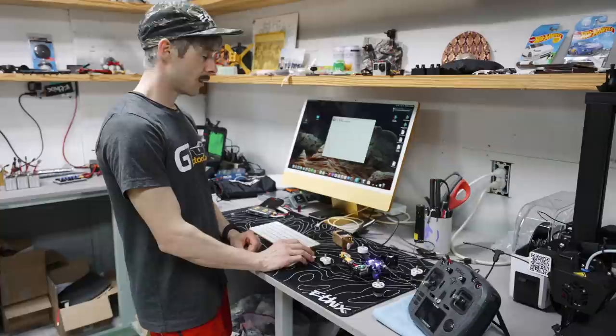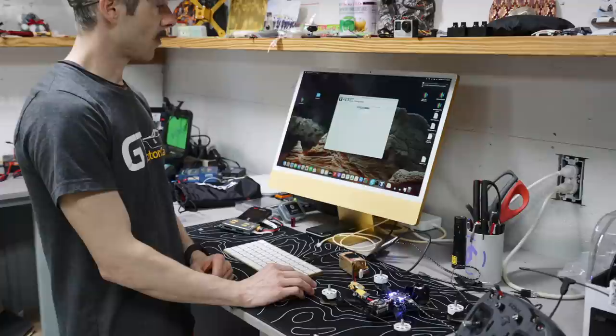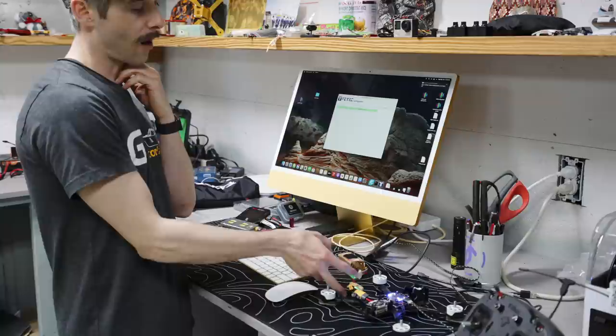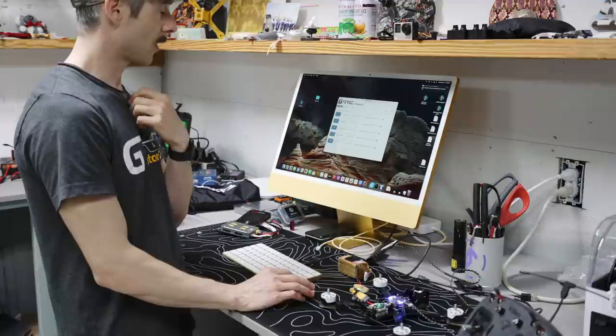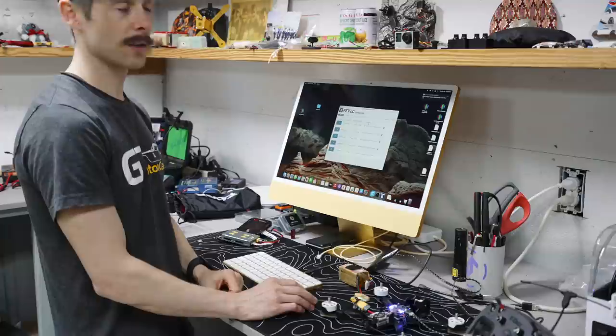interact with the G4 flight controller and this 45 amp ESC. So when we're going to the ESC, you gotta click KISS pass through, and then we're gonna connect, and you have to have power to the drone itself so that the ESC can be seen. Once we're in the ESC, we're gonna select remote firmware and go to the latest one, which happens to be Fettec 45 amp 1.0.224 at this current moment, which is March 30th, 2022.